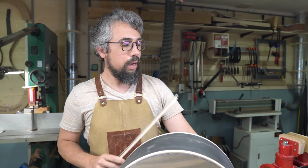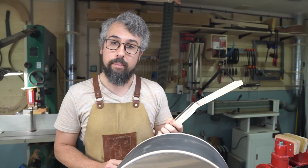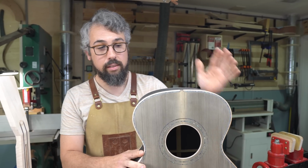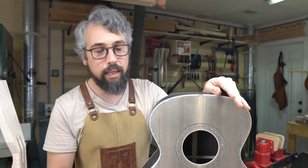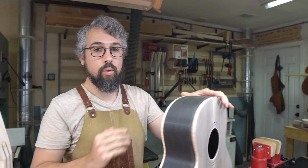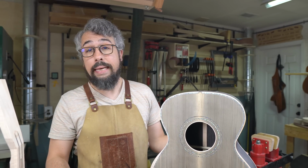It's looking good. The gut reaction for me always is to just, oh, now I can glue the fretboard on. Right before I get ready to glue it on, I always remember, crap, I have to cut the mortise and tenon first. And there's more to cutting the mortise and tenon than just that process. It also is the very important process of what's called setting the neck, which is the process of getting the neck angle correct in this direction as well as in this direction, so that when we finally put the strings on this guitar, everything lines up geometrically correct. So that's what we're going to do in this video.